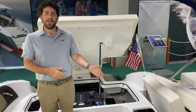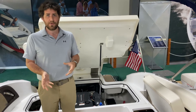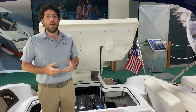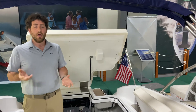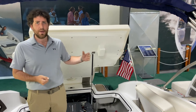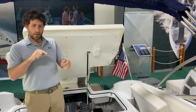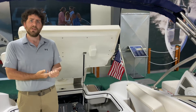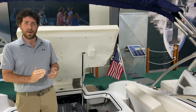In the past, we've had battery systems where you have to select battery one or battery two in these dual battery systems. But today's modern boats come with a system called ACR. What ACR does is it automatically applies a charge to the battery that needs it the most, based on how those systems read the voltage in the individual batteries. So whereas the old switches used to be off, combined, battery one, and battery two, we now only have a three-position switch which consists of off, on, and combined batteries.